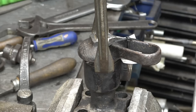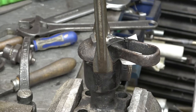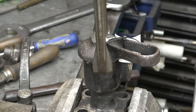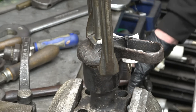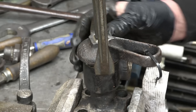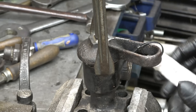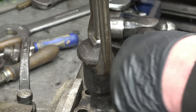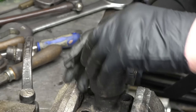This just does not want to play. The next thing is to take it up to the shed and put a little bit of heat on so it can expand — that might help to spring it off; I think that's going to be the next plan of attack. There's a lot of weight on there now and it's going nowhere. That's the injector clack valve, and I've also got the pump clack valve to do once we get this one sorted. We'll go put some heat on here and see what happens.